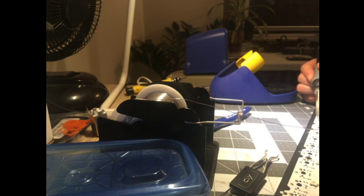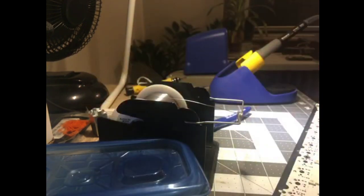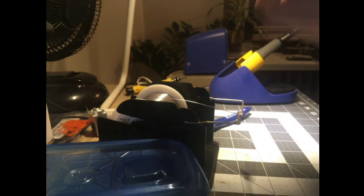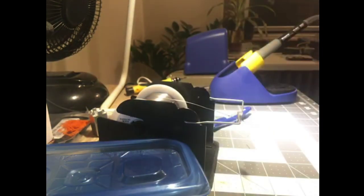We're almost done, kids. Now, again, here's a nice custom keyboard thing. If you have a fresh PCB and it's your keyboard and you really want to take care of it, one thing you should do is make sure the pins are nice and straight before you solder the joint. That will just make it that much easier to desolder. Those are flush, right? Yeah, they're flush. You can actually look down. I keep forgetting to show the camera. I was actually looking down the line to make sure it was flush.